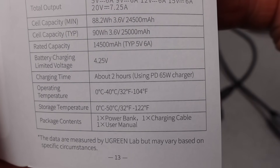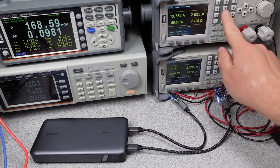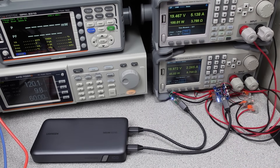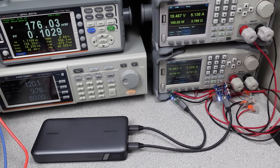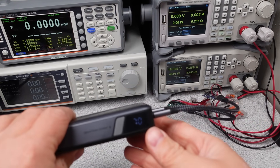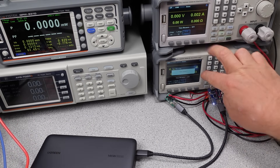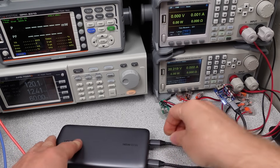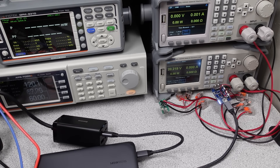Let's look at claim charge rates. I made a chart of devices from previous reviews showing how many times the power bank can charge each device. It looks like the energy in this device can pretty much charge anything — it might not be the fastest, but at least it can do it. The power bank can do 145 watts of power output, but don't expect it to do it for very long. It only discharged to 70% of the rated capacity before turning off. Interestingly, only the 100-watt port shut down and the 45-watt port kept operating, which makes me think the electronics are overheating and not the battery.